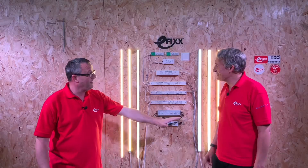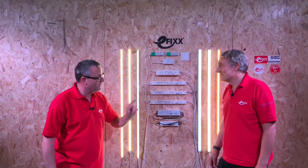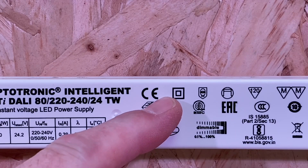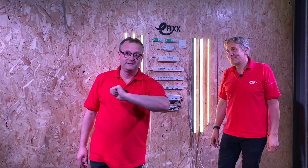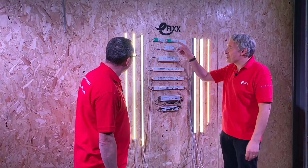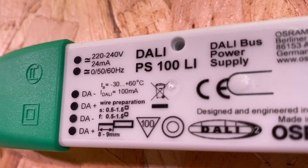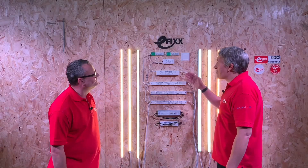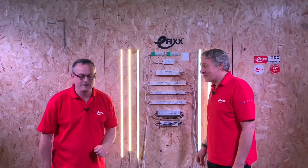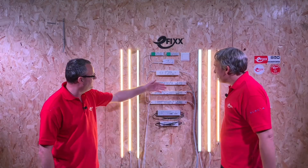I'm going with this one here — a square within a square. That's the symbol for double insulated, Gordon. Well done, it's a difficult one! And a circle within a circle means reinforced insulation, and it can be used inside something that's double insulated. Okay, so there you go — you're off and running. I've done the first one. The rest of them are all easy.